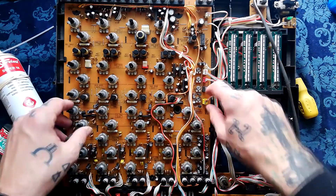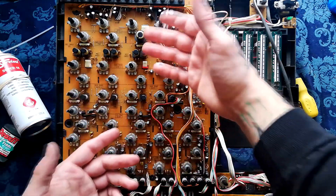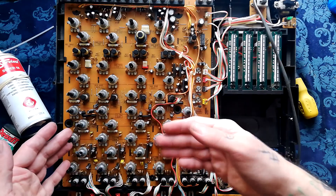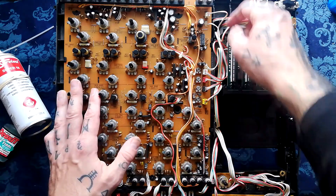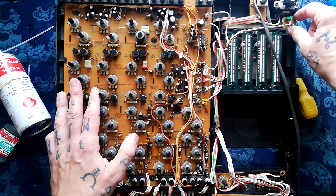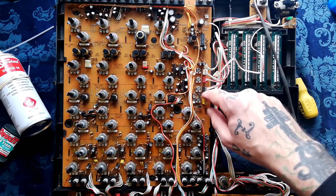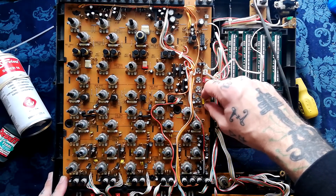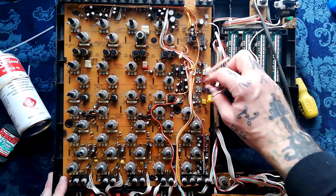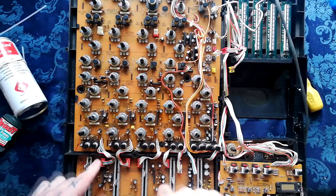Let's say we've got some sort of electrical issue and we need to trace or solder - just inspect the underside for lifted tracks or cold joints. What's connecting us here: we've got a two-pin cable going over to what I guess is the power indicator LED. These sockets are nicely annotated on the PCB, which isn't always the case with these multi-track recorders, so that's good.